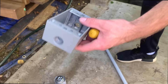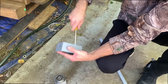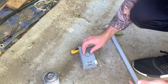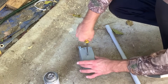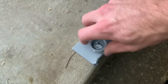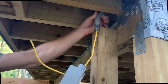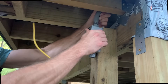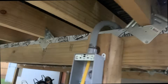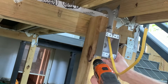Next up, we're going to install our GFCI outlet using one of these exterior-rated outlet boxes. You attach the mounting clips to both sides and fill any conduit openings you're not going to use. In our case, we don't need the one in the middle since we're going in through the top and out through the bottom. They have threaded connection fittings to connect from the outlet box to the conduit incoming and outgoing. Apply your PVC cement and attach the conduit to the outlet box, then attach the GFCI outlet box to the piece of blocking installed previously.